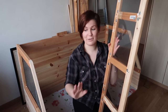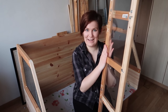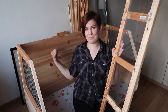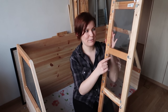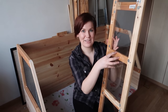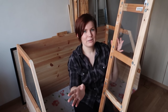Unfortunately, I cannot attach this piece to the front of the cage just yet, because there is one thing I forgot to do, and that is to varnish the wood on the inside. I'm going to be varnishing with white varnish the whole substrate border, the front, the side bit, and the back piece as well. With this piece, I really should have varnished it before putting the perspex on, because if I try and do it now it's going to be really difficult to do it around the perspex and not get it on the perspex itself. So I'm going to have to take that off, varnish it, let it dry, and then put it back on and attach it to the cage. So if you're recreating this yourself, don't make that same mistake.